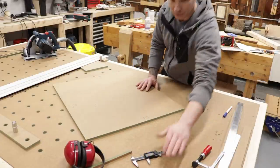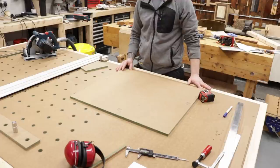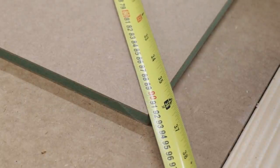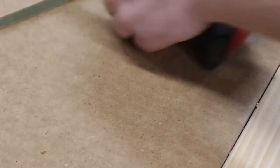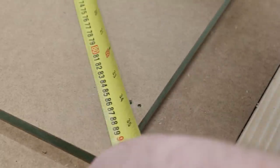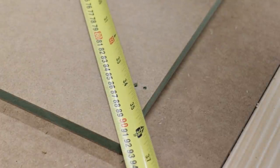We're off by only, what did we say, 0.0125 degrees building our fence. So our fence works. Building a sacrificial fence took me all of 10 minutes to whip one up, so yeah, happy days. So there's a close-up of that, as close as I can get you. So there we go, just under 92 centimeters, just under 920 millimeters. That corner, I'm going to rotate it around to the opposite corner. Hopefully you guys can see this on camera. Have I got that on shot? I do, just about. There we go. So again, bang on, to the millimeter. So guys, I would call that perfectly square.